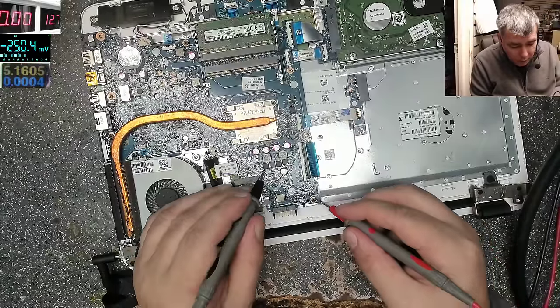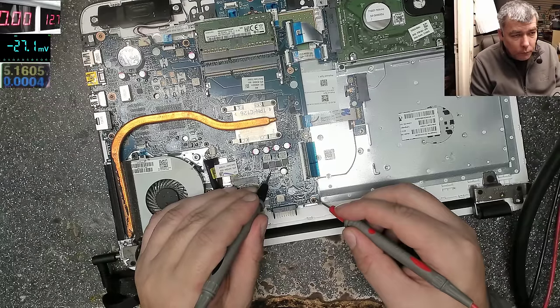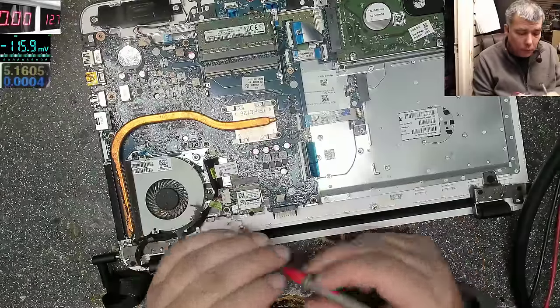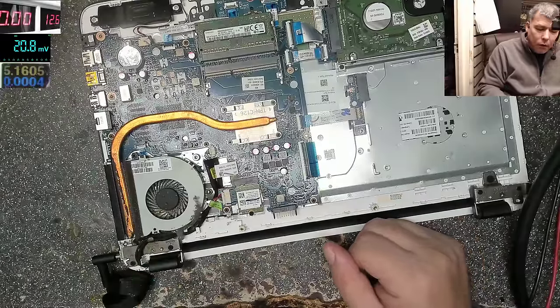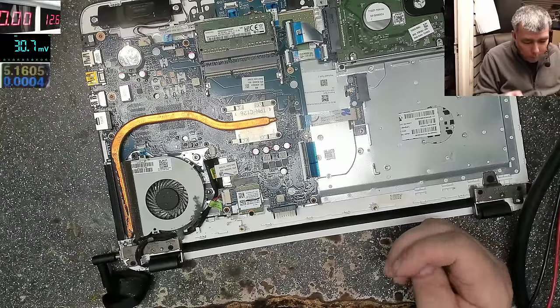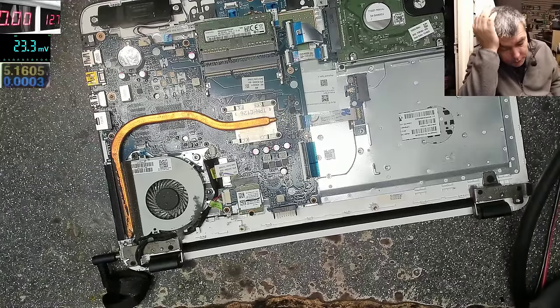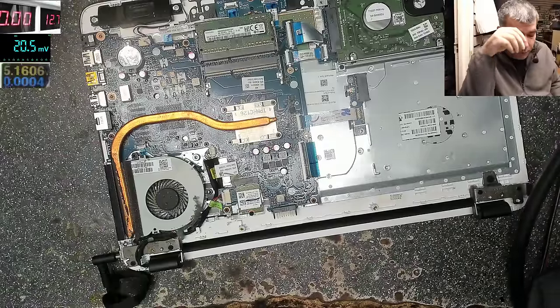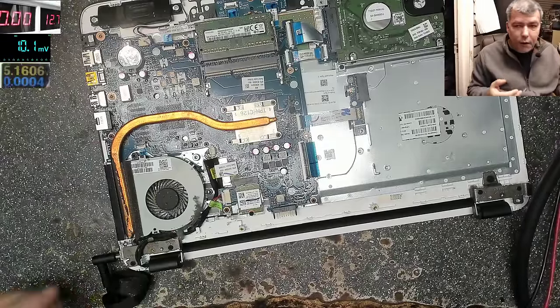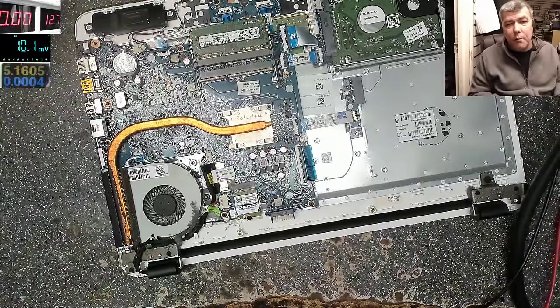So it's no voltage. Nothing. It's zero. So our 19 volts power rail is missing. Okay, I was thinking it would be something more interesting, but anyway, you can find this fault in two ways. Let's stay away from the power supply at this moment.